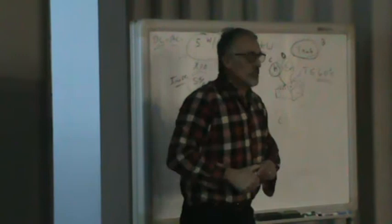We've got these factors. Let's do a screening experiment. Let's see if they matter. So the heat is factor A. The ambient temperature is factor B. H is factor C. And emissivity on the radiation is factor D. So I have four factors. How much heat can the double E's help me out with? What's my room temperature? What's my convective coefficient on the top? I just looked at the top.